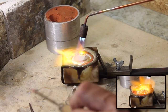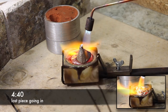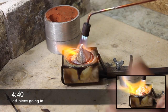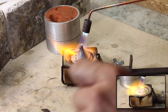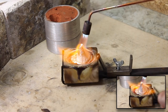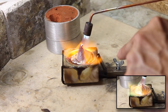And if you're melting down jewellery, you've got to watch out for springs. You'll get steel springs. Just put that big lump in there and get some heat on that. If you've got lobster catches and bolt rings, you get steel springs in them. So once it goes liquid, just use a solder pick or something and you'll be able to rake those out. Now you see, this is going to be easier to melt now because it's going to pick up the heat from the stuff underneath it.